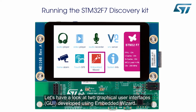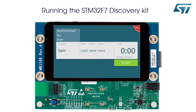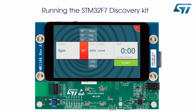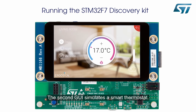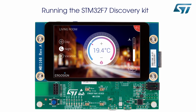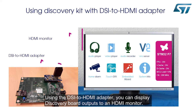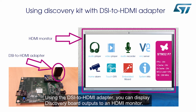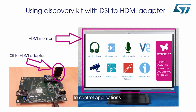Let's take a look at two graphical user interfaces, or GUIs, developed using Embedded Wizard. The first GUI simulates a smart washing machine interface. The second GUI simulates a smart thermostat. Using the DSI to HDMI adapter, you can display discovery board outputs to an HDMI monitor. A specific firmware is required because the touchscreen is no longer available to control applications.